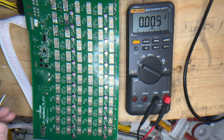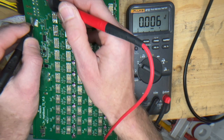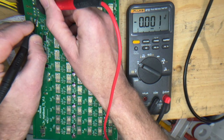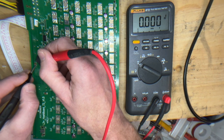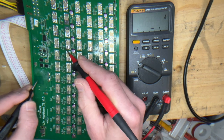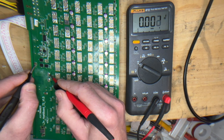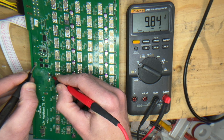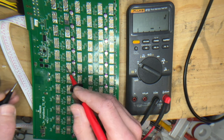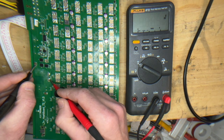Andrew here with ASIC Basics. We're going to go ahead and go through a quick voltage check on our board when we first bring them up. We want to check our 12-volt power coming in, and another spot for the 12-volt power going into the 10-volt buck converter. We want to check the output of the 10-volt buck converter — that's basically what you've set your hash board to run at, so if you set it to 9.5 or 10.1 which is Bitmain default, that's what you'll get. We'll have this across both sides of the inductor.